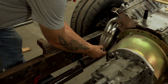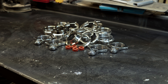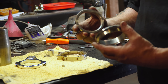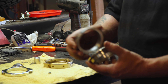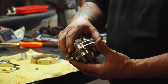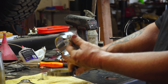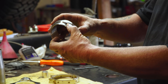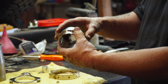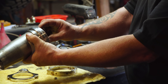Now it was time to lay out the remaining path of the exhaust. With the help of a few jack stands, I set up the straight section of tubing as high as I could in the chassis to make sure the exhaust doesn't get caught on anything while driving. Once I got everything lined up, I made a few marks with a sharpie pen to help keep things aligned when I go to weld them together. The Deeds V-band clamps feature a female and male register, so instead of the clamp slipping and sliding, these actually index — once tightened they go back to the same spot every time the exhaust comes on and off.